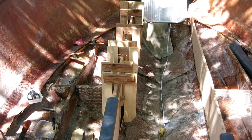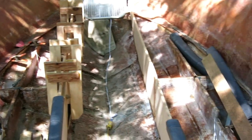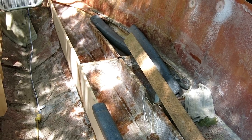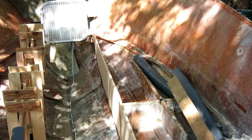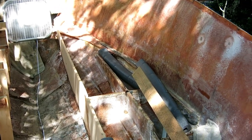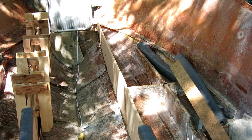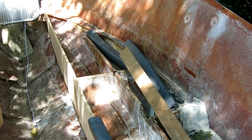I just glued my fourth Divinycell section. Now I need to come over to the second stringer and open it up - cut the top off, cut it about an inch above the floor, and get the interior laminate off. I have to cut back that little bulkhead a little bit. I don't have enough resin or laminate on hand to start laminating the outside of these, but I do have enough to set probably two more pieces and get this side cleaned up, cut up, and ready to go.